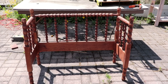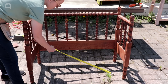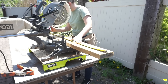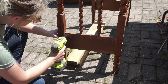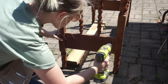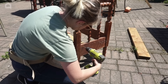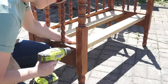Now that the frame of our bench is completed, we can move on to making a seat. First, I used a tape measure to measure the distance on the inside of the side panels. Using this measurement, I cut two pieces of wood for a base for my seat — I had scrap wood, but if you don't have any I would suggest using two by fours. I drilled pilot holes in the side panels, placed my wood pieces in, and then used three inch screws to secure them through the side panel into the pieces of wood, repeating the process on the other side.